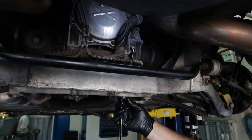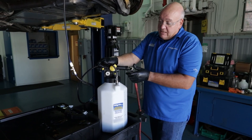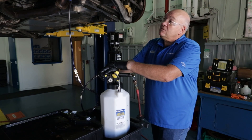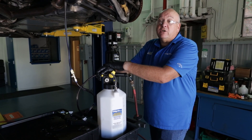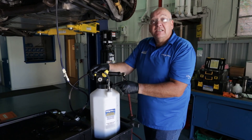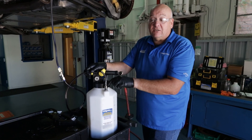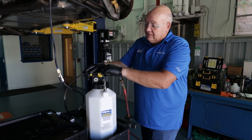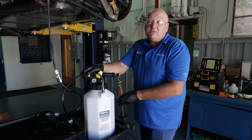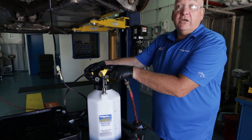All right, we've got our fluid moving. The MV7110 and the other MV7100 series components are usable with any automotive fluid except for fuels and DEF. DEF is mainly excluded because it can cause corrosion and could cause problems with the seals inside these quick connectors. The MV7100 can be run on shop air anywhere up to 120 psi.